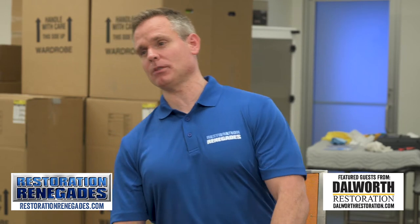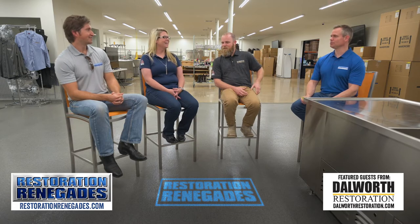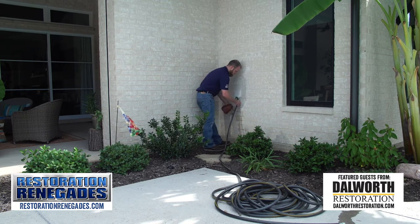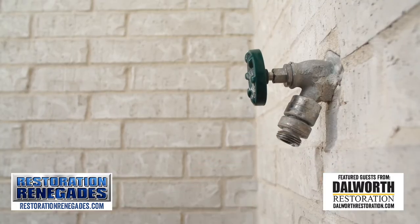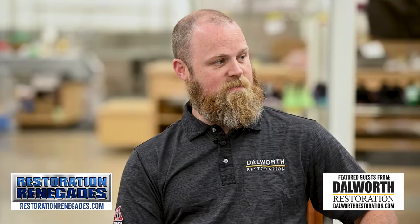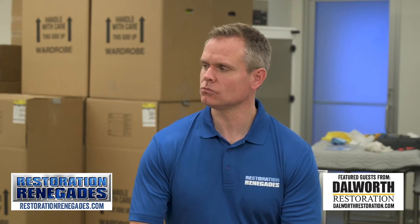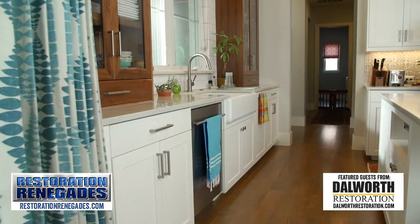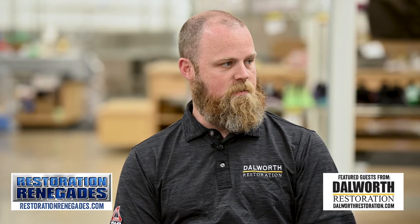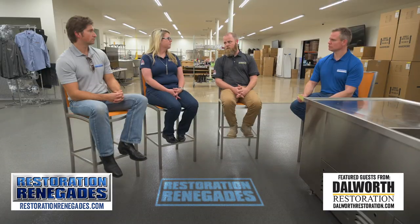So the first thing you can do is go down to your local supply store like Home Depot and buy insulated covers and wrap all your hose bibs outside — that would be the cheapest and most effective option. On the interior of the house or building, any walls that have plumbing on the exterior, go ahead and open cabinet doors and allow the heat to go inside the cabinetry, and that'll hopefully keep them from freezing up and busting on you.